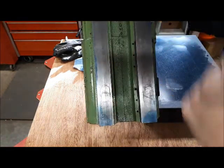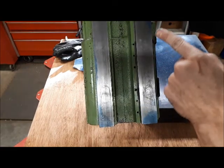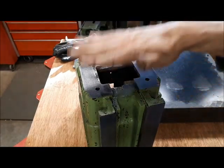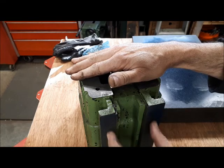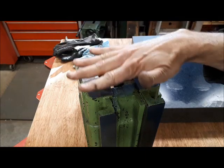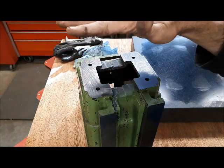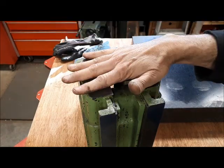We got contact at the four corners, a little bit down along this edge here, nothing on this side. The reason I'm looking at this is because this is where the spindle head mounts. I put it up on the surface plate with the column ways down, and this appears to be out of square. So this being square to the column can be done within this casting itself, and this becomes a foundation for the spindle head and then of course the knee.